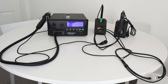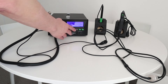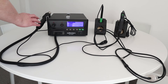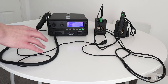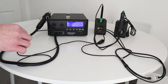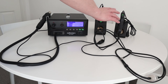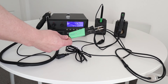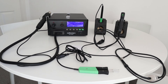Overall, a nice bit of kit. The maximum power is 900 watts, so whatever devices you attach — and you can buy additional Multicomp devices — they must not exceed a total of 900 watts at any one time. The heat gun itself takes 550 watts of that, so you're already down to 350 remaining. The soldering iron included is 130 watts, though you can get up to a 150 watt soldering iron. The desoldering gun is 150 watts, and the desoldering tweezers are 100 watts. As you can see, when you start adding these up, you need to be mindful of the 900 watt maximum.